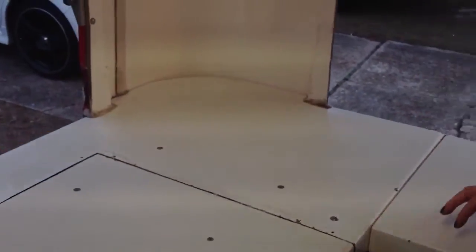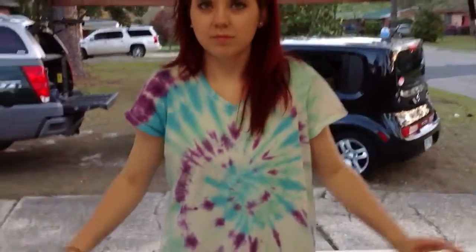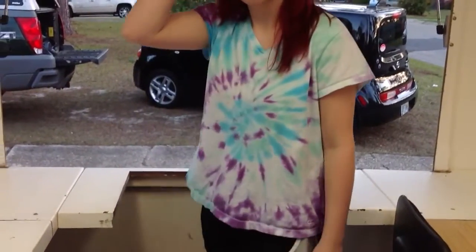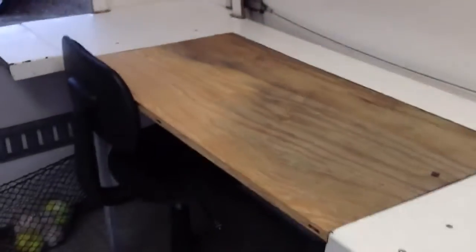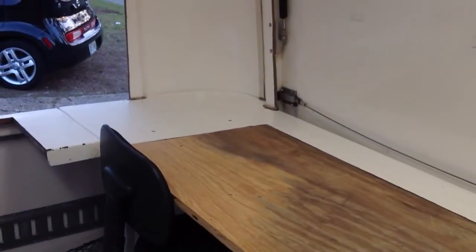You'll see where it was cut out for a cooler. We took what was cut out for this cabinet and replaced it on the counter. On the one end, we left it open and Anna steps up into it — it gives you a lot better access to people when you're serving. It's good to take orders over here and give orders over here. On the other side, we just took a piece of three-quarter-inch plywood cut and put it in there. Everything can be removed if you want. You can put some melamine in there so it matches the countertops better.